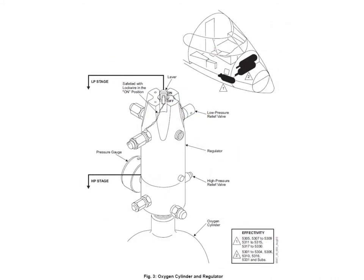Here we can see the two different configurations — dual bottle and single bottle. If you've got the dual bottle, the oxygen cylinders are located in the forward electrical compartment — the same compartment where the TRUs are — one above the other. If you've got the single configuration, it's installed beneath that area with an access panel on the side. They all look similar in terms of the bottle head.